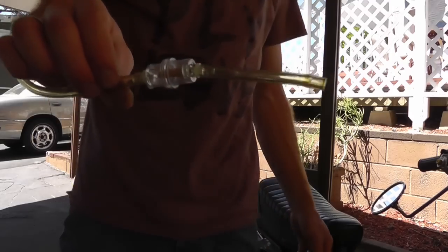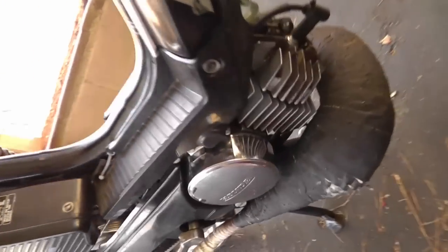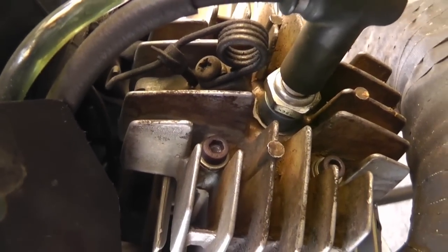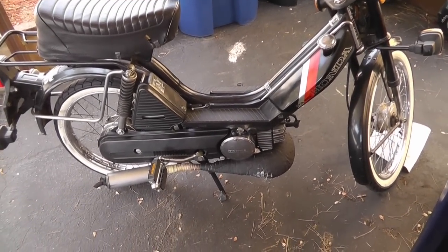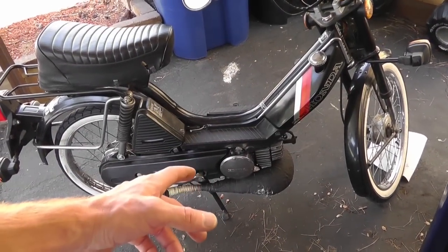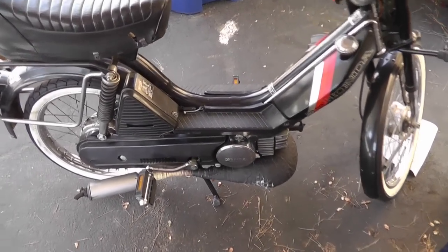So I removed the inline filter. I took everything apart, cleaned stuff, put it all back together, adjusted things — I thought it was the head leaking — but it turned out to be just the filter. The head bolts on here are not regular head bolts; these are standard high-grade socket head cap screws. A proper head bolt is a high-grade tempered special bolt. I'm not sure the originals were that type, but I've had lots of issues with the head bolts coming loose and have to constantly re-torque them.